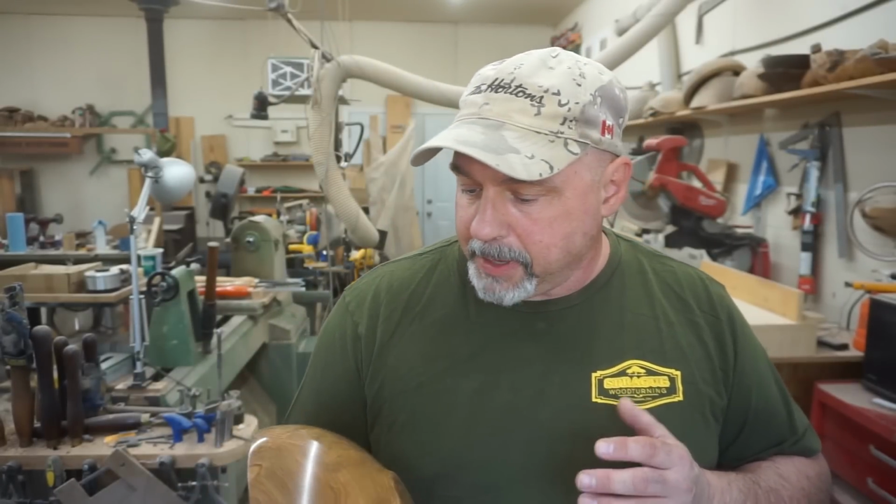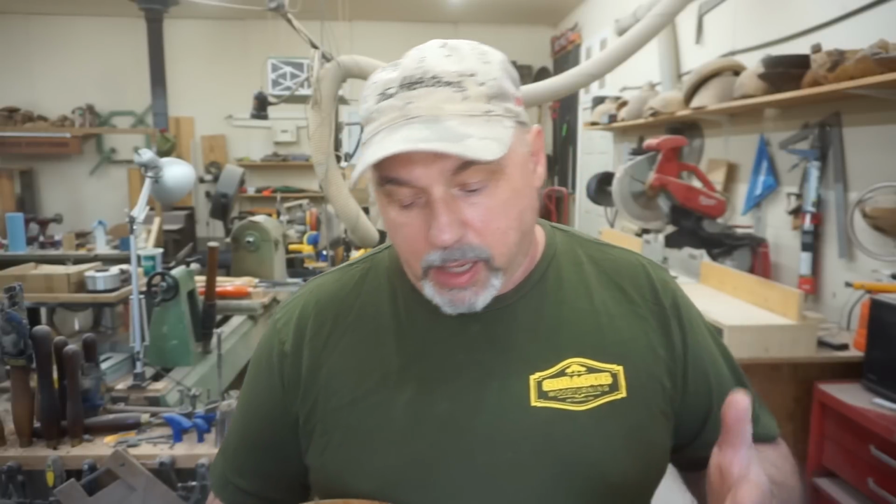If you've been here for a while, you know that I've been looking for a replacement for the General Finishes solid bowl finish. Now they've rebranded it into wood bowl finish and taken the food safe tags off of it. So we've tried out a few things here, or at least I have. Right now, this is the number one contender for sure. Again, it's not as easy to work with. That Polyx oil from Osmo is a really high solid, really thick oil.